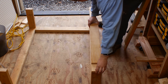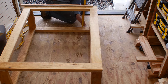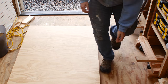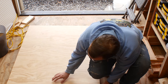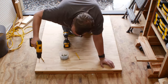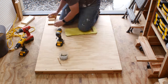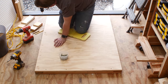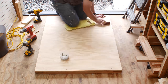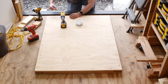Painting the glue with a silicone brush ensures even distribution without ruining a regular brush. Once the frame was dry, I did a test fitting to make sure all the shelves would fit perfectly with the cabinets. It's a good thing I did, because it turned out I had mis-measured and accidentally cut my supports too long. Too long is better than too short — after some careful measurements, two more cuts, and another dry fitting on top of the cabinets, I finally had everything to the correct size. I then screwed the bottom plywood into the frame with inch-and-a-half decking screws.